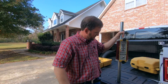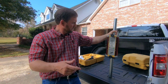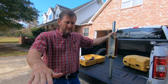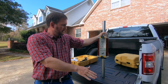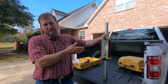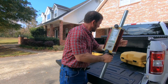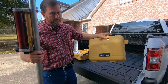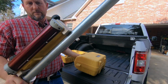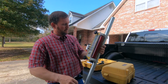I've done two projects with this. The one you're seeing in this video is the first one. I set a stake out in the field where I wanted to come out even — where I wanted the drainage ditch to come back to natural grade — and I was within a quarter to half inch of the grade when I got out there. So it's very accurate. This is a Topcon LSB 110.